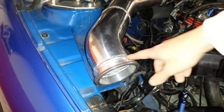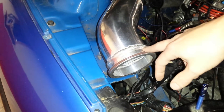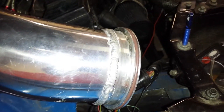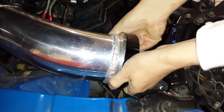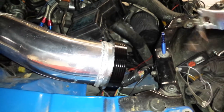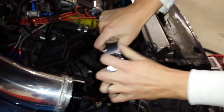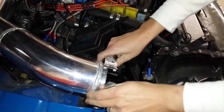The way it works is there is a ridge on each pipe that gets welded on, and an o-ring that goes on the ridge. The connecting piece will have a similar ridge, and then a piece of anodized aluminum goes over both ridges. The clamp just clamps the ridge around the o-ring, and that makes the flexible yet airtight seal.